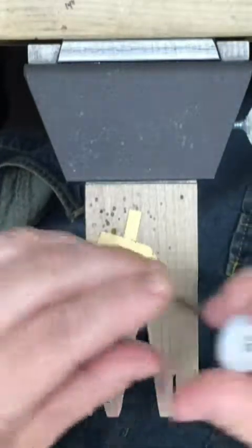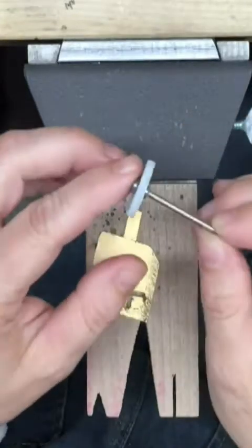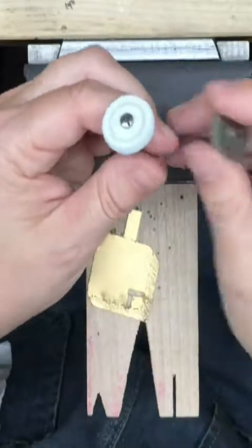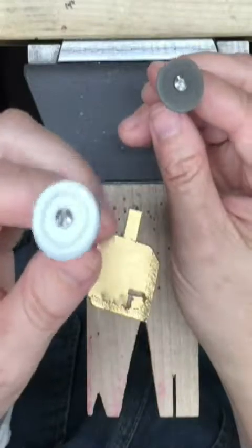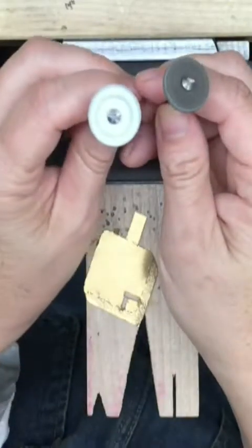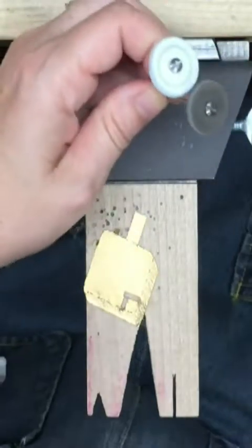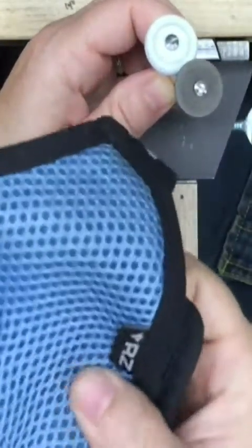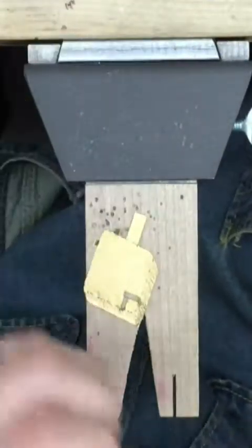I don't have one in my... Sorry, I should have replaced that. This is a silicone wheel from 3M. They're impregnated with different grits. Richard has a video series on this. You need to watch it. I'll link to it in the description also. But these things are excellent for a quick cleanup. One thing though, if you're using these, you definitely need a dust mask. There's some nasty stuff in here you don't want breathing.